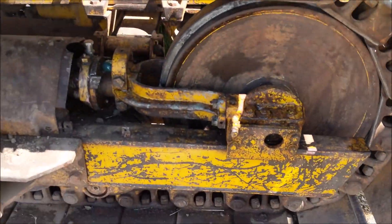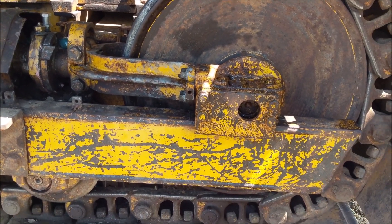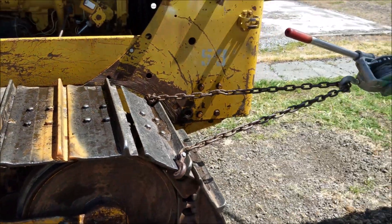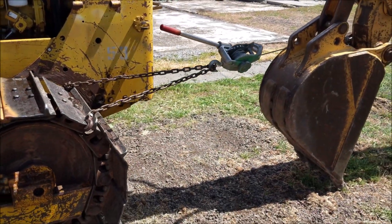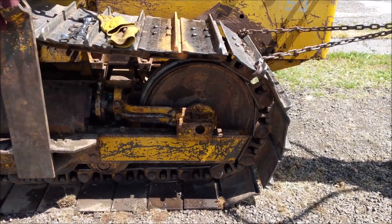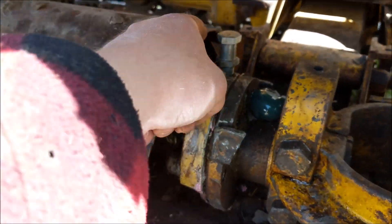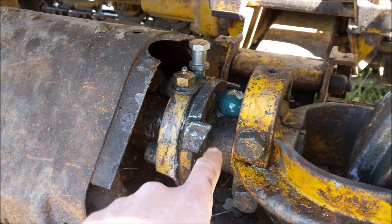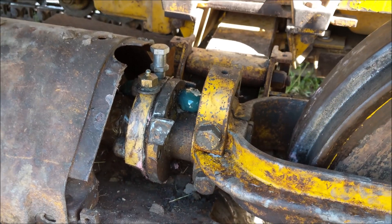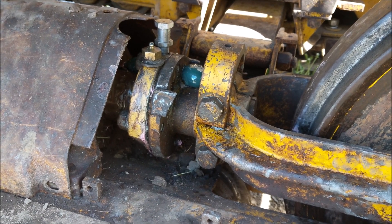I've got all the hydraulic pressure released and the bleeder is still loose. The idler is pushed in so it's not under tension. I've attached the track to a fixed object and pulled that up to give us more slack on the idler. Now I can start — I'll loosen those bolts here first, get those just loosened, then start taking these brackets off. Then take this bracket off, and the piston will slide out, revealing the piston inside so we can replace the seals.